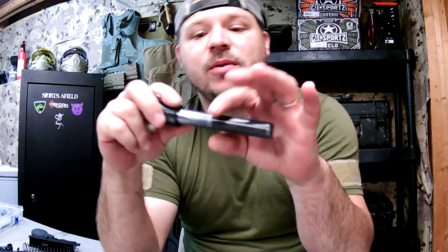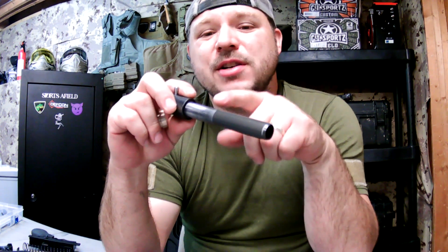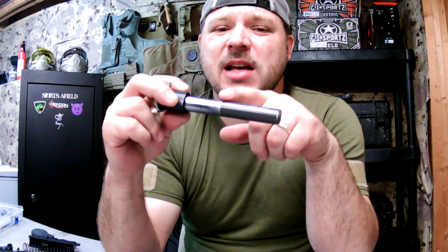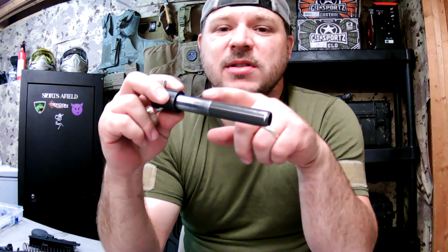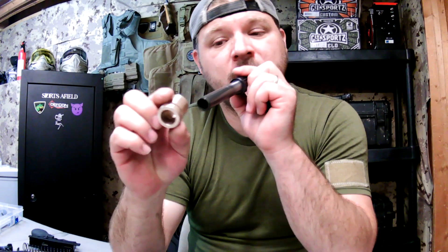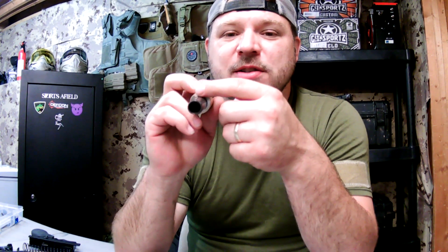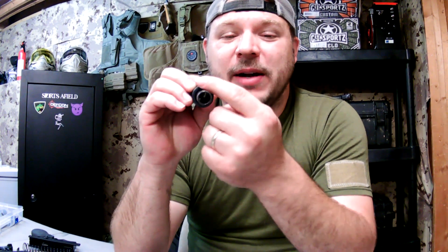The more important reason is what we found at the machine shop: when we measured with a super high-precision measuring device, it turns out that one half of the bolt is a couple thousandths of an inch wider than the other half. This bushing was turned specifically for this bolt — it has fifteen thousandths of an inch gap all the way around.